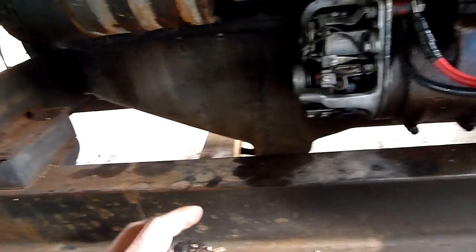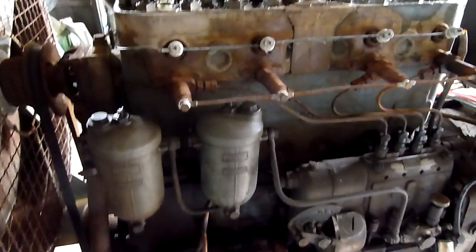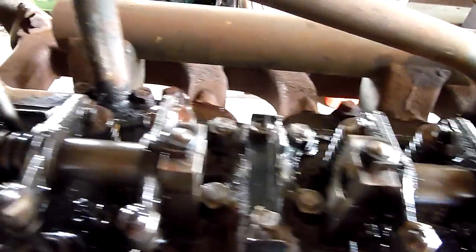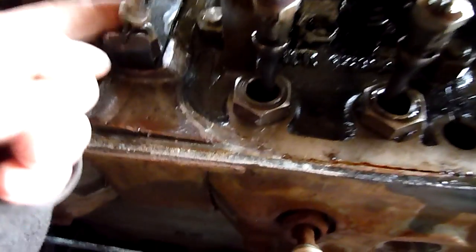Just basic safety checks: make sure there's a way to stop it, make sure there's a way to start it reliably. I pulled the little drain and a bit of sludge came out but no water, so there's no water in the sump. There's still oil in the sump within safe operating range — it's not the best oil, but the drain wasn't completely clogged and the top end isn't sludged up. It actually looks pretty good. There's even a lead and wire seal on some of the bolts.